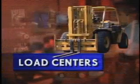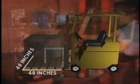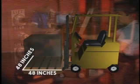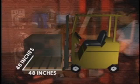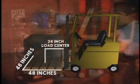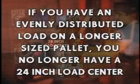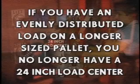Now, before we explain what all this means, let's explain this load center. The load center of a forklift is the distance measured from the center of the load to the vertical face of the forks. If you have a standard-sized pallet, it's 48 inches by 48 inches. If you have an evenly distributed load on this size pallet, you have a 24-inch load center. If you have an evenly distributed load on a longer-sized pallet, you no longer have a 24-inch load center.